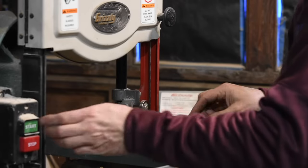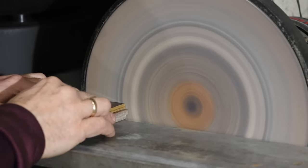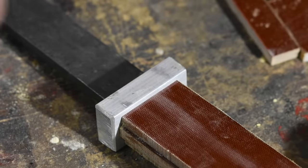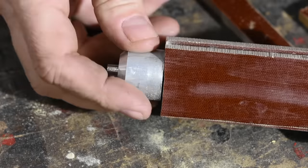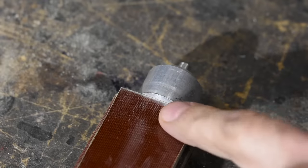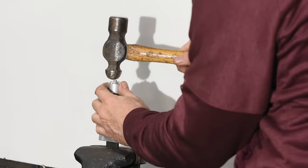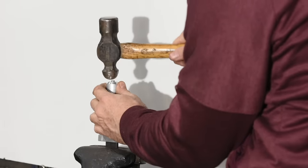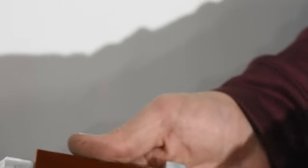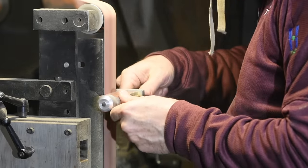Once it's glued up, I'll trim the ends on the bandsaw, then flatten them on the disc sander so that they mate dead perfectly — both flat and square to the guard. On goes the pommel. Then, after trimming that little extension on the tang, I'll peen down the end. This is the kind of technique you'd see on antique daggers, medieval swords, things of that nature — very old school. This technique has been used literally for a thousand years. In real life, I'd shape all the parts before assembly.